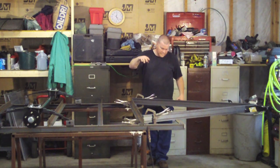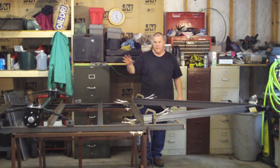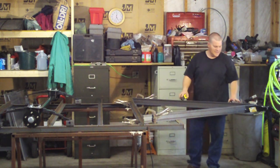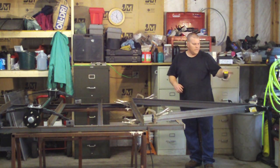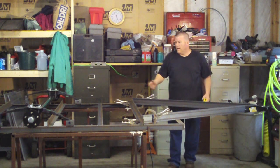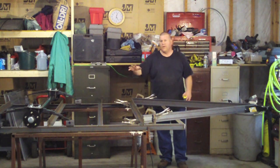We're going to do some welding — this is critical welding, by the way. Also, don't forget: when you mount this, make sure the hitch is upside down while your trailer is upside down. It's easy to forget that and then flip the trailer over and find your hitch is upside down — you'd have to cut everything apart. The hitch is made for a two-inch ball. Now I'm tacked up and ready to weld everything while the trailer is upside down.